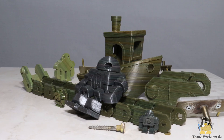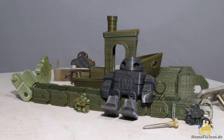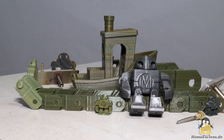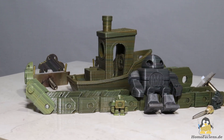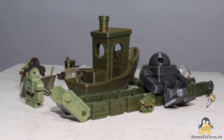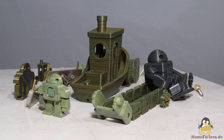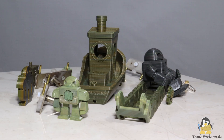Plan A is to smooth the inside of the tube with a reamer or by sanding and polishing, possibly electro polishing. Plan B is enamel coating. Further down on my list are inserts made of other materials, perhaps a stack of different tubes on the inside. There's still a lot to experiment with.